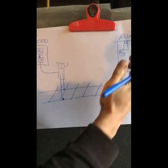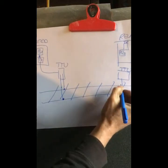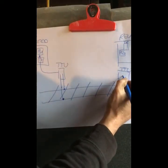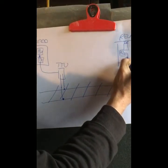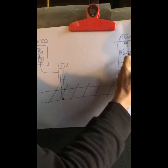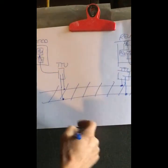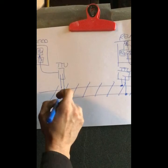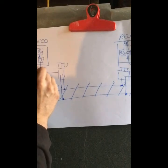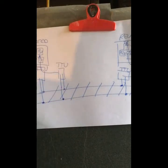This creates our tune zone, our track circuit, because remember there are no joints in this system, unlike the conventional track circuits where we have insulated block joints. We connect onto our rails again, and then our TTU feeds into our receiver, our RX. Now, our receiver outputs a voltage of 40 to 44, 46 volts that feeds our track relay, repeating back to the interlocking. Our next track will then have another TTU here, and that will go on to the next and so on.